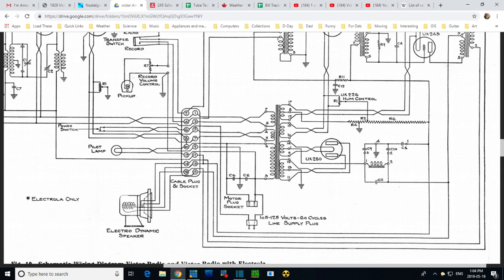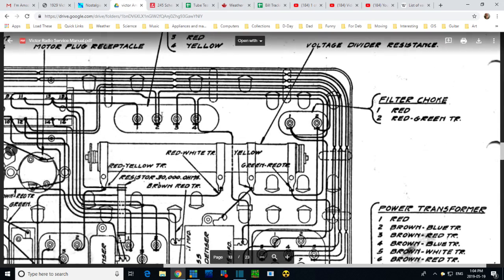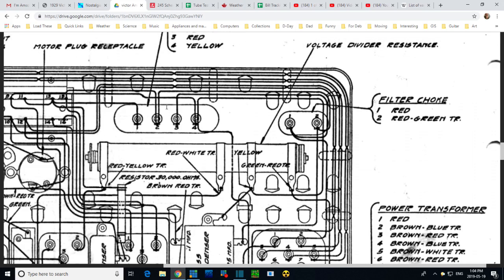Okay, so that would be correct. The negative side of those two capacitors was connected, and looked like connected to a terminal that went to the chassis. The two positive sides are connected together also. So it's either that combo is replacing this guy or replacing this guy, and the other original one is still in there doing its job. And somehow disconnecting that lead, which isn't shown on the diagram here, was a beneficial move.